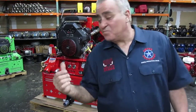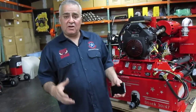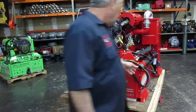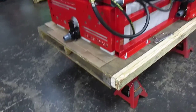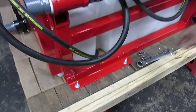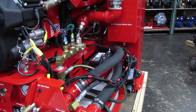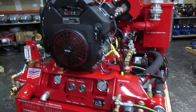When it comes to the stack design, because of its shape, it makes a person think it would be extremely hard to separate this machine prior to installation. But I'm about to explain to you how easy it is. All of our units come bolted to heavy-duty carrying pallets that we order for the safety of the machine in transportation. The only two wrench sizes you're going to need are 9/16 and 7/8 to separate the whole area when you need to separate the machine from the main frame. Let's get into how we're going to take this apart to install it.